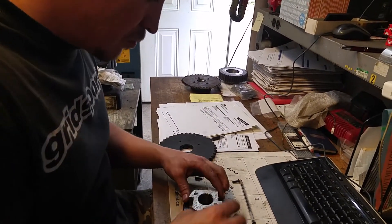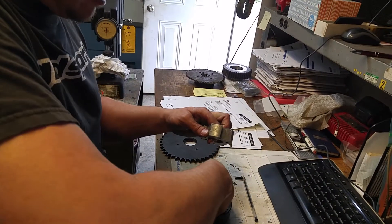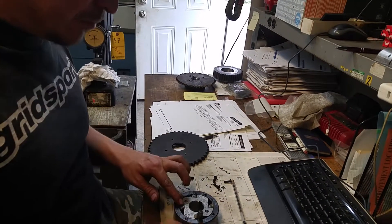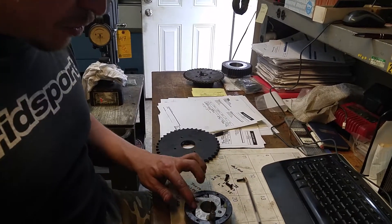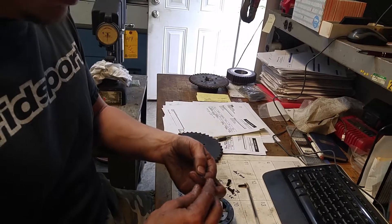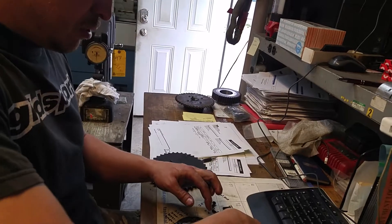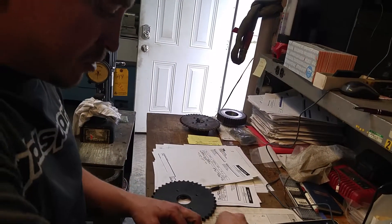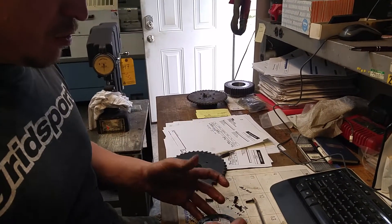Pretty crafty little design. It's easier to pull them out and put the pins back in there, and then the little springs go with the arc towards the pins. It's not rocket science the way this works, but it's really unique. Shove those down in there, make sure the pins are square. After you tighten the set screw, then you put it all back down, back on top of here, and then you're locked down.